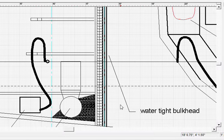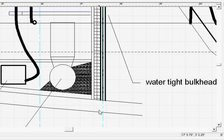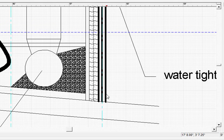This bulkhead is a watertight bulkhead. I'm going to share some of my patented designs with you. So this is the keelson here. And on the other side of this bulkhead will be the forward cabin. The forward cabin is the owner's cabin, which will be where I'm asleep. Maybe not on passage, but nonetheless, this will be the master stateroom here. So this bulkhead will be 1.5 inches thick. It will be 2 sheets of marine grade plywood with, I believe this is 2 inches.